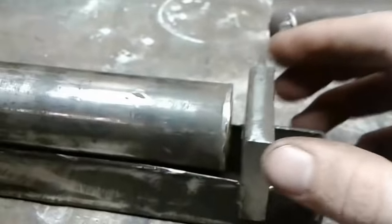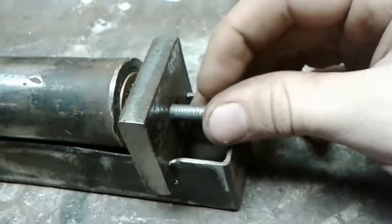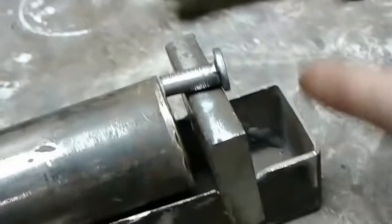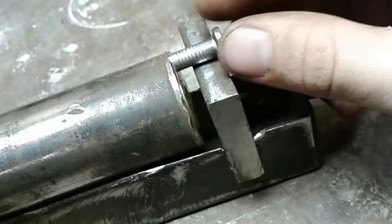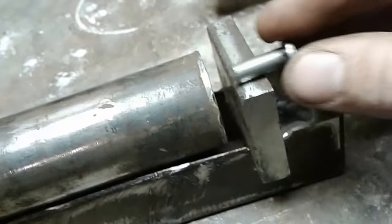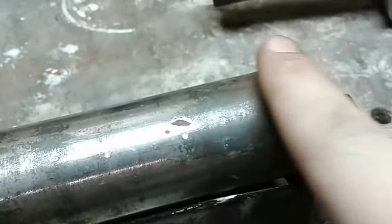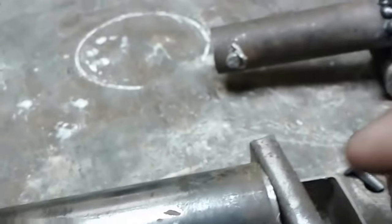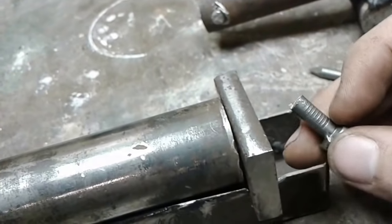So my new plan is I'm gonna challenge myself — I'm gonna make one of those specially designed ones where the hammer is flush but the firing pin is a separate item. I may take an angle grinder and cut notches out, because I'll also be putting a latch on here. I'm probably going to be grinding this area flat so it will accept a large enough bolt, or I'll probably be making one of my own, drilling straight down and tapping it so it will stop here.